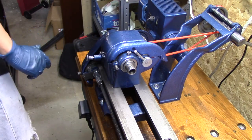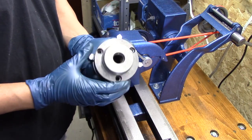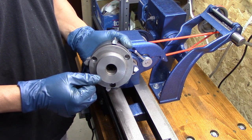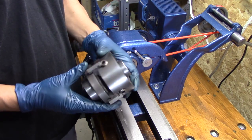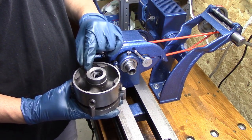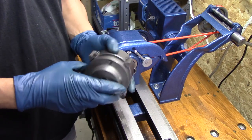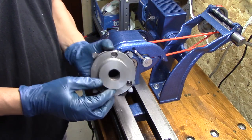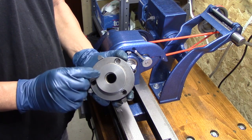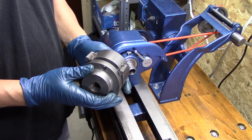What I need to do is take this back plate and get it turned so that everything works out. I'm using my four-jaw chuck, and you can see back here where the four-jaw connects — it's only about a quarter of an inch thick around there. But on this back plate that goes on the six, it comes with a lot more meat on it, so I have to take down a good half inch of that cast iron off of there, and I'm gonna chuck that up and get her going.